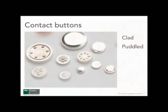Contact buttons are generally used where a contact rivet might ordinarily be used, but you're going to experience relatively high temperatures or high swings of temperature from low to high. These contacts are welded to a terminal or a blade, and generally the weld is a relatively small area, but it remains constant over long periods of time, regardless of the electrical and mechanical stress.